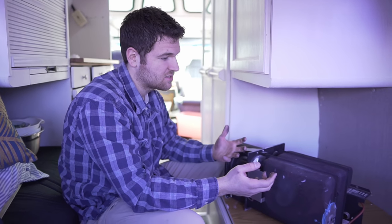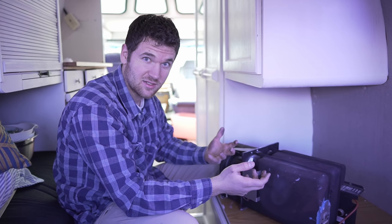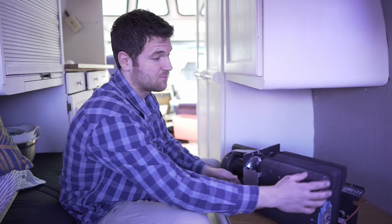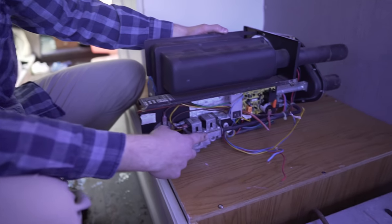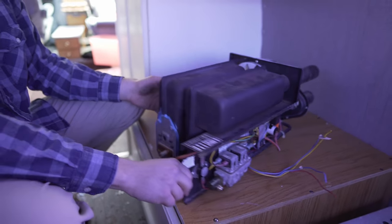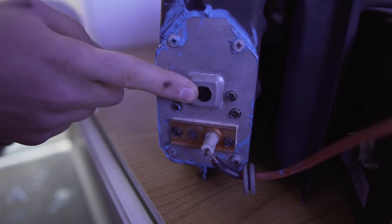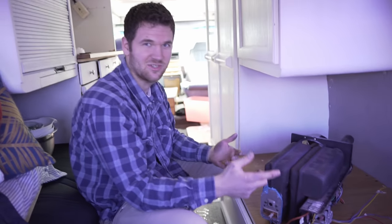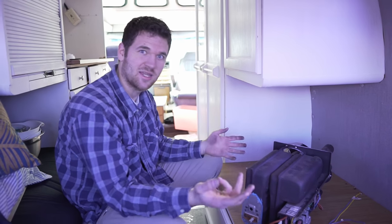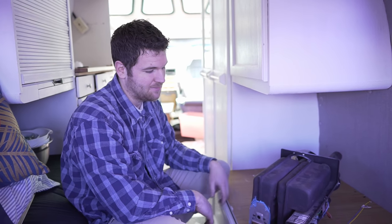All right, so in our case with the furnace, we were getting all the way to flame. So basically all the other operations were working. The fan was blowing, which was tripping the sail switch, which was then letting propane in through here, which was then being ignited by the electrode here, and there was a flame through the peephole. So very frustrating. After 7 seconds of just triggering the electrode, it would just shut off everything, and it would try that 3 times, and then it would just lock out. The fan would blow for an hour and nothing would happen.